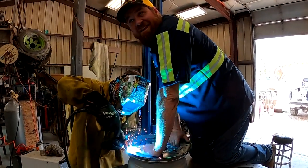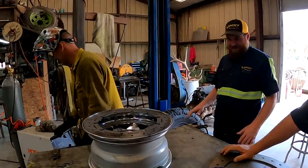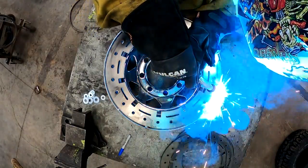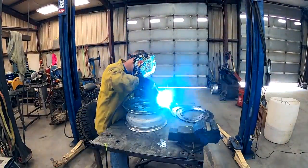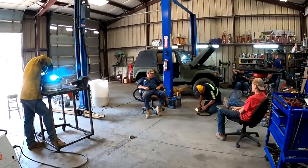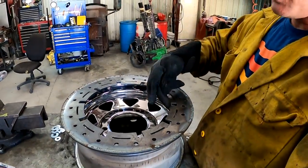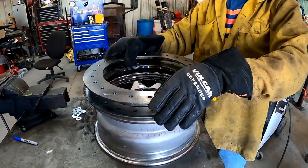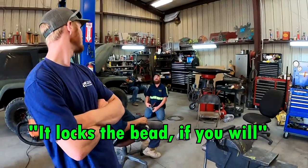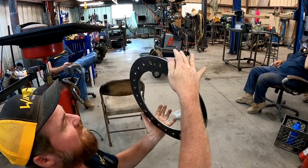The question is, Paul — how many and which ones am I going to burn my hands really bad on? It's all welded in. These are called anti-coning rings. Basically what you do is you bend those up, and then this goes down and hits them so it doesn't dimple in. Then it pinches your tire in between here and here and they can't come out — it locks the bead. I'm deburring, but Robbie did such a good job there's no burrs.